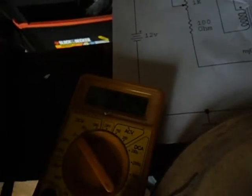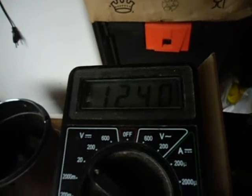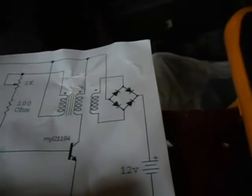Now I'm going to 340 milliamps in. Look at the charging. 12.64, 65. And the primary is slowly going down, and it's 12.40. So it's definitely better. Now there we go, 12.66. This was not happening in the standard way.